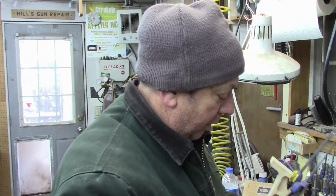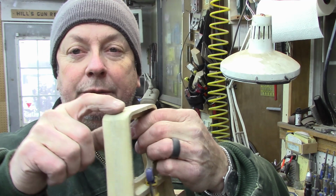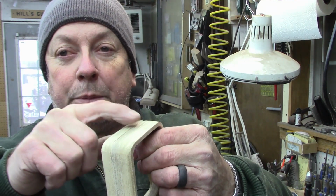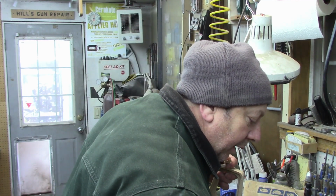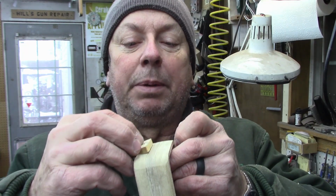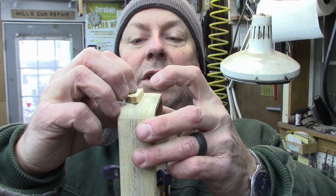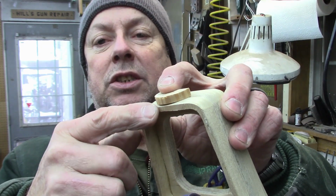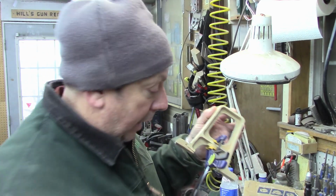Now the top one I didn't screw up, but I could have done it differently. What I should have done is on my very center section, I should have left a little indentation for the boss. That would have defined that right there. Now these pieces are big enough, and I just took some dowel. I don't know if this is an inch and a half, an inch and a quarter, an inch and 3/8, I guess, is what this dowel actually is. If I would have defined this well, I could have set these up just the way the rest of them are. Now there's enough dowel here that I'll just split the center distance with them. I'll have to flatten the top a little bit and set them on, and that'll bring us just about to the right diameter, and we'll just fill in the rest. Not a big deal. But that's something I would have done a little bit differently had I taken the time to think about it.